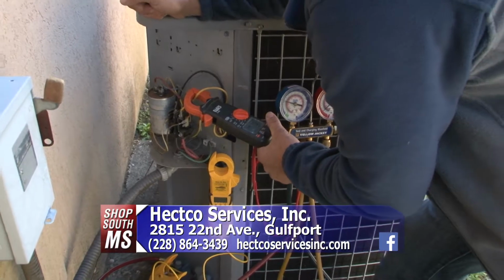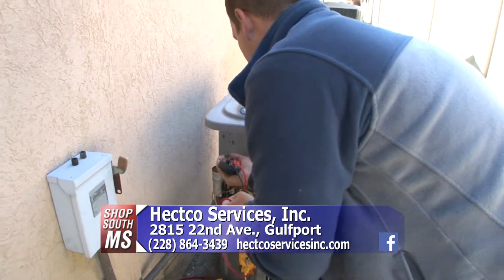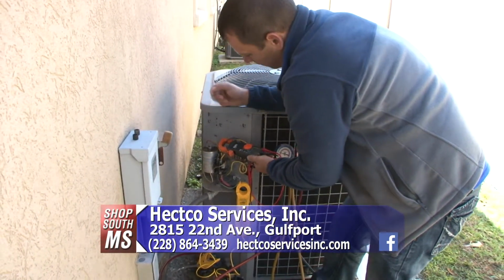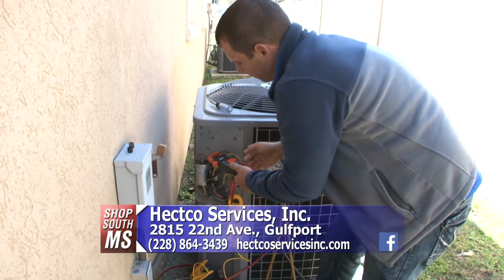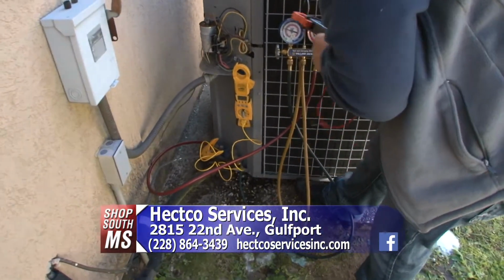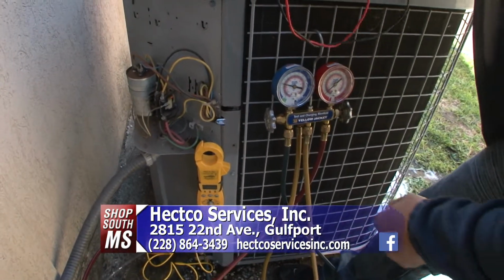Make sure that everything's reading properly and that you got enough. Correct. Yes, sir. And then from there we'll go over, and once we make sure that everything is working properly on your electrical components, we go and check all of your Freon pressures, your high side, your low side pressures. We're going to make sure that we got proper refrigerant pressures in the unit. Okay. And then we're going to move inside and show you what you need to have done there.